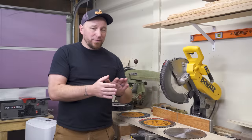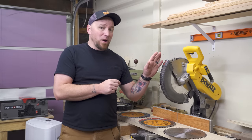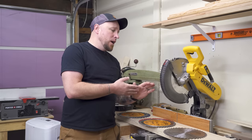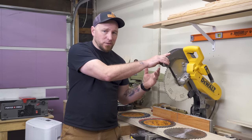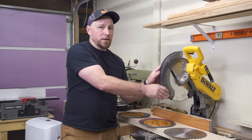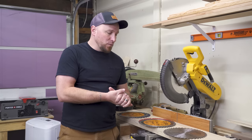Out of all these blades, honestly they've all been pretty good, some a little better than others. I know someone's going to ask about my miter saw blade — this is a 12-inch miter saw with a CMT Orange industrial line blade. It's a full kerf, 72 tooth count, alternating top bevel with a 10-degree hook angle. It's an excellent blade — not super aggressive, but it doesn't baby the material either, so I can get decent speed through some pretty interesting stuff.